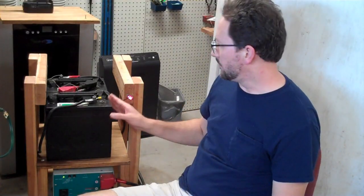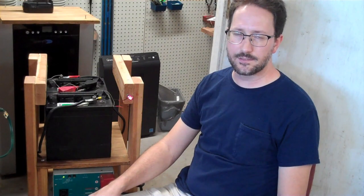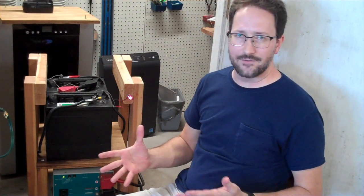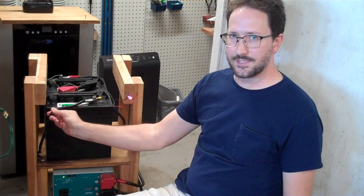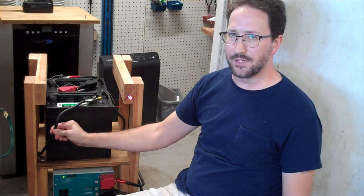If you're using a lead-acid system, I really like keeping it at 12 volts. All these accessories are 12-volt accessories — you can buy inexpensive 12-volt battery chargers and inexpensive 12-volt inverters. The big downside is the number of amps you need to draw. If you're trying to do a 240-volt inverter doing 2,500 watts out of a 12-volt system, the wire, although it's big, isn't big enough — you need a much bigger wire for that.